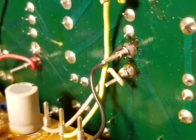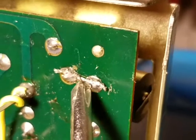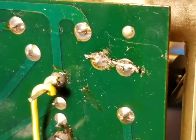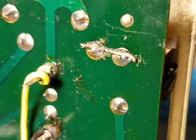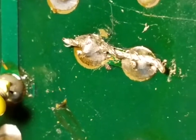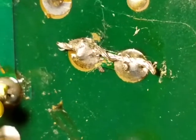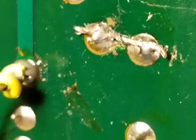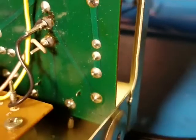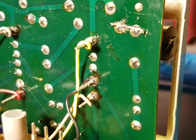I also want to take a look at those. I know it's not pretty, and don't mind that black stuff — that's just from the soldering iron head. But yeah, it works. The reason I put that bridge in there is because when I was re-soldering that left joint in the pair, I actually felt that little copper plate kind of pry up a little bit from the side, and it's not supposed to do that. So just to be sure, I built a bridge right there in case they weren't making connections somehow. So I'm going to take a little peek at a few more of these, see if they need a little more solder or need to be cleaned up, and then I'll test it from there.